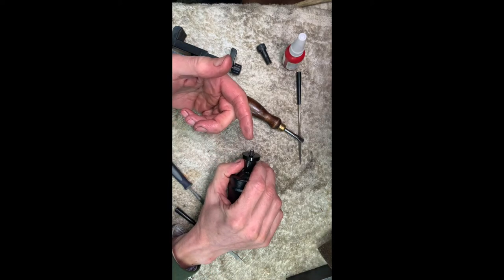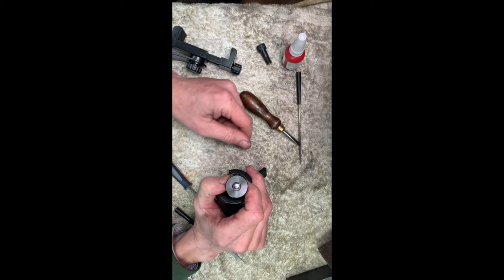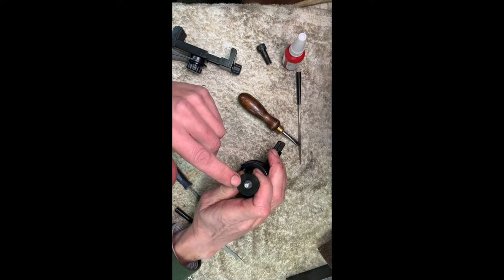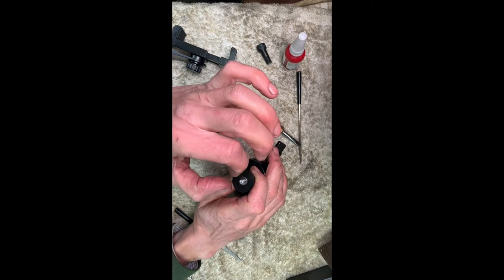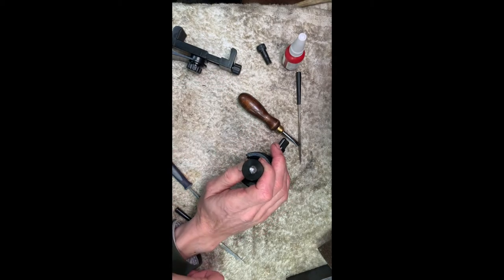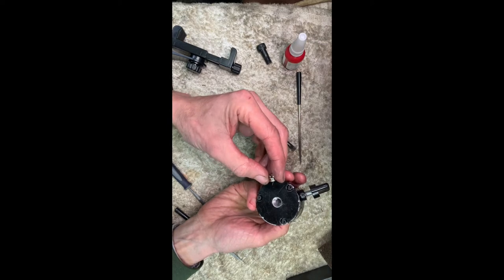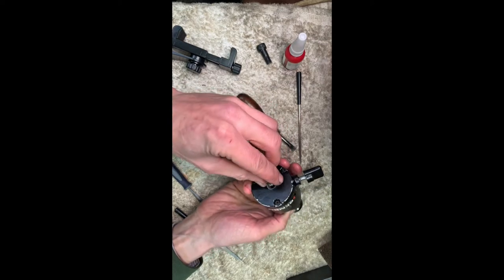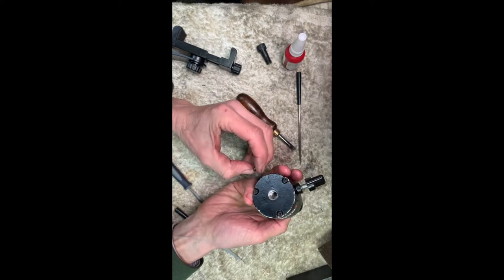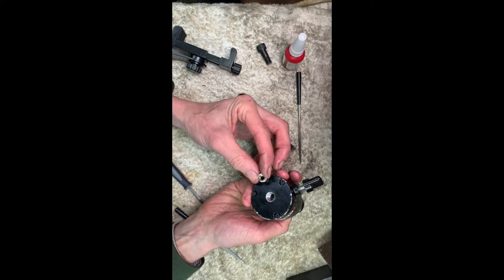So that gave me a longer thread that's gone in than if you bought it, and I can cement that in if I wanted to, and I've still got the chance to unscrew it using these two little lugs. At the back side, this is a thread adapter, you know, that's what you buy, but it's short, it's not engaging very far, so I'd probably make one of those if I was going to adapt that thread.